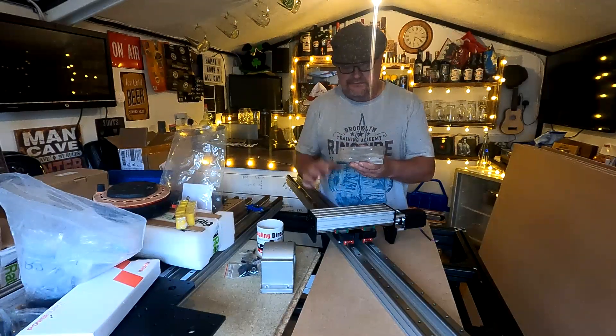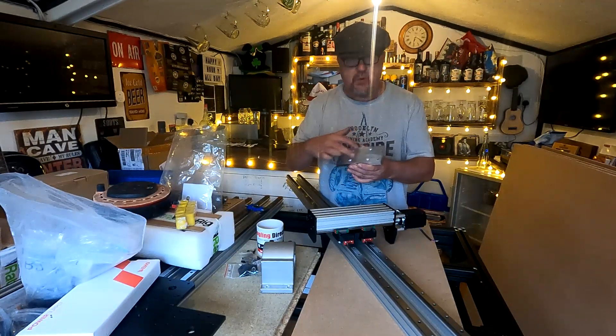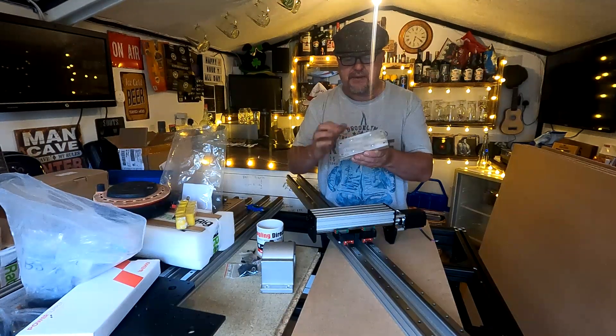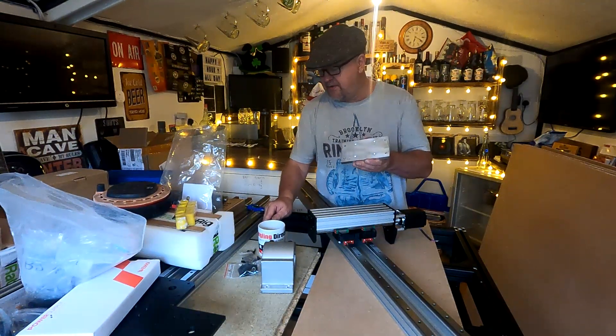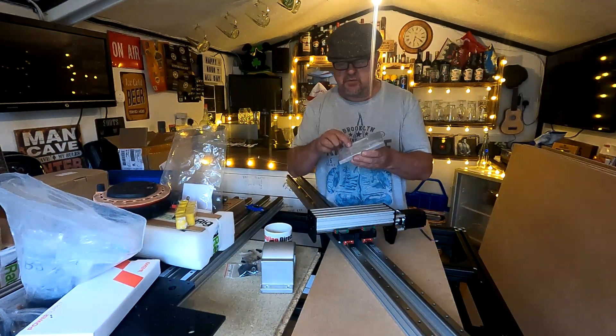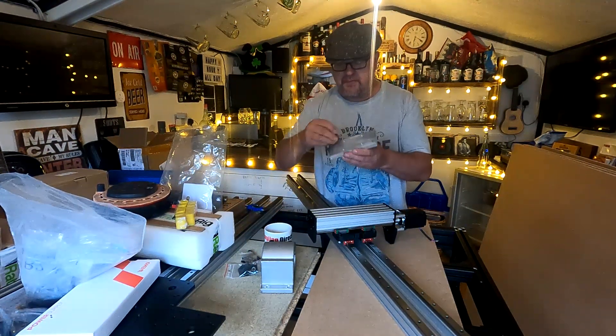I've put six holes in there. Four holes at 60mm pitch, and they've been counter-bored to accept 5mm screws. So I don't need to use the raised-head screws there — I can use normal cap-head screws which will just drop in.